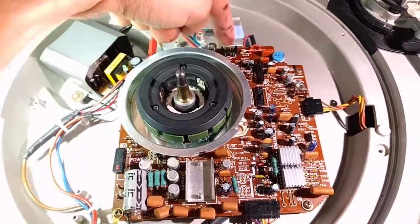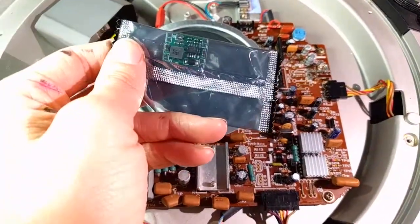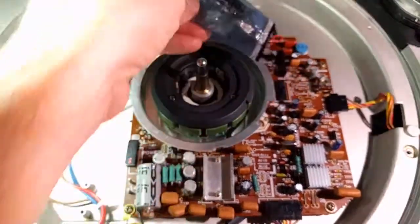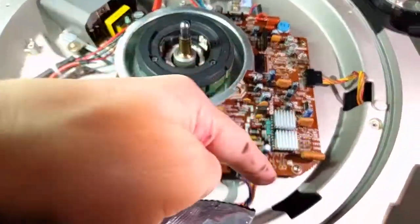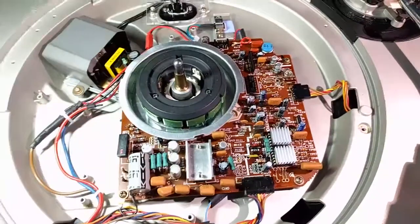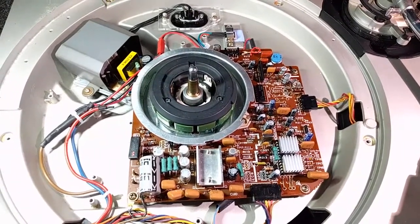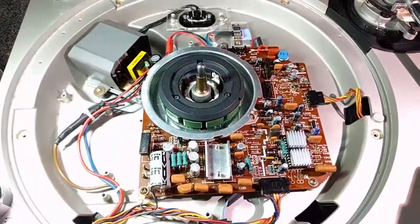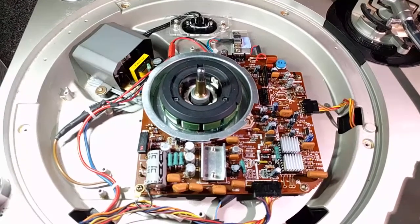What I'm thinking of doing: this plug will stay at 21 volts, but then I'll run that to a typical DC-to-DC step-down converter. I forget the part number right now, but these are used in everything. I can mount it over here somewhere, get 5 volts, and from that 5 volts power an Arduino and then put the LED light for the illumination track. That way we're not working with 21 volts, or as I previously did it — running from the 10-volt regulator and doing a resistor. That's just janky. LEDs don't need that kind of voltage.